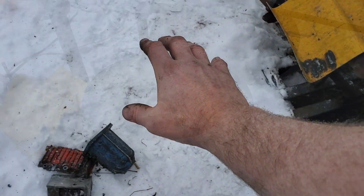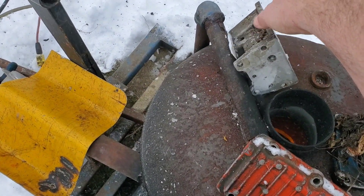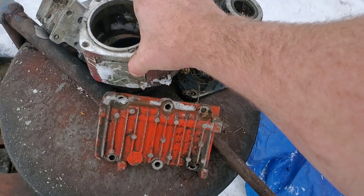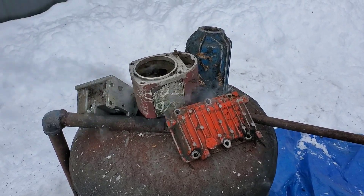You don't want to put anything in there that's wet. The water problem is easily solved by putting it in a really hot place and letting the water vaporize to steam. There have been many tragedies over the years by putting something wet in the molten crucible — it sinks to the bottom and blows up. I'd highly recommend you buy a proper crucible and not use a metal one.